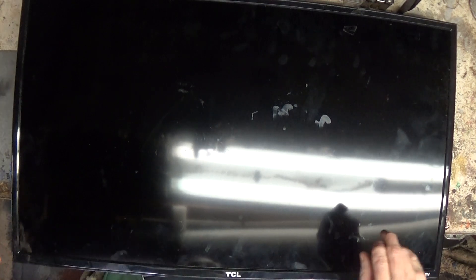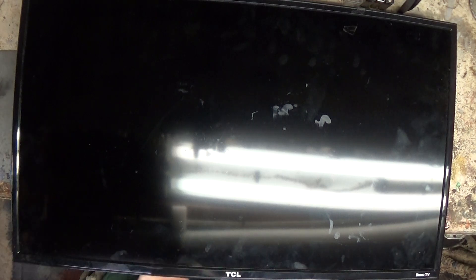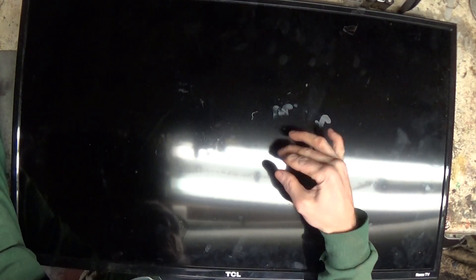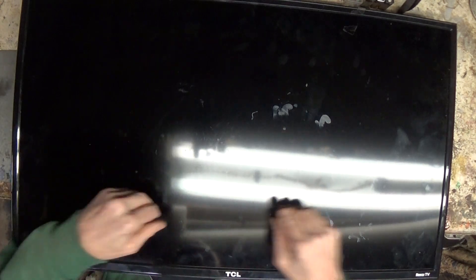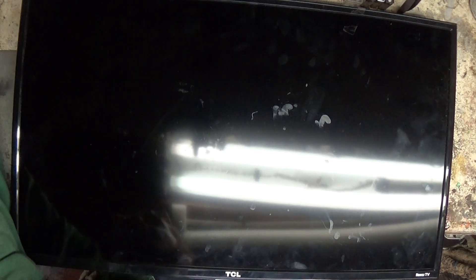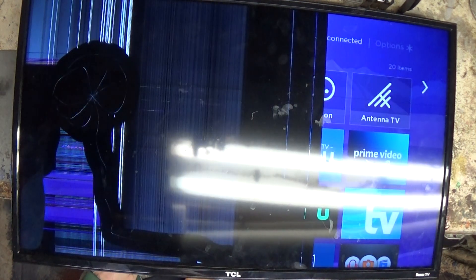You're probably talking like a little 5-volt supply going on inside the TV right now. Mains is hooked up to it, but it's drawing about six watts with just this little light going and a little internal setup connected to a relay. Once you hit the button, it finishes that contact and the big power flips the switch and kicks on. Hit the button — boom, it comes on. No remote with it. It went up to 29.1 watts.